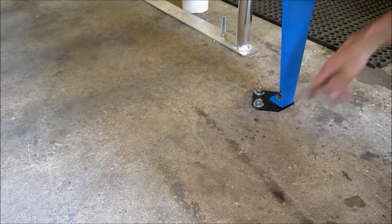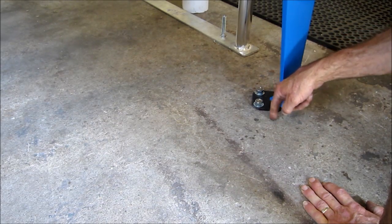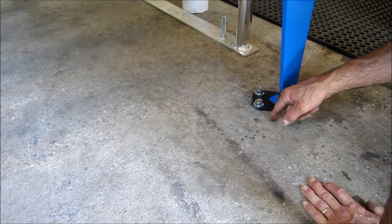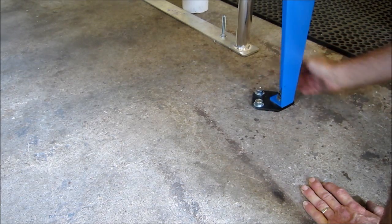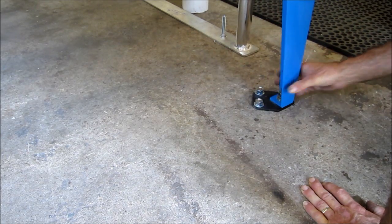This is how I anchored it down to the ground with an adapter plate because I didn't feel there was comfortable room to drill and put a lag in at this point. Also, if you've ever drilled in concrete at close tolerance, the very first stone you hit — I don't care the quality of your masonry drill — it is not center-drilled to keep your hole straight. It'll deviate your drill and you're going to cause undue stress on your lags. So I came out here where it was comfortable and I put in two half-inch lags with slots so I have motion in there.